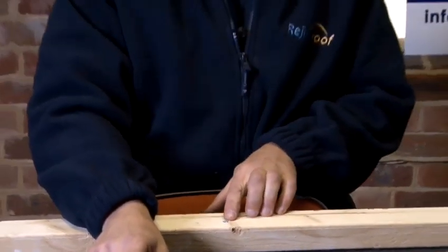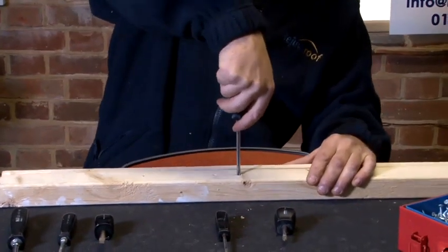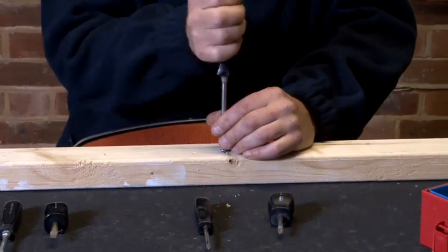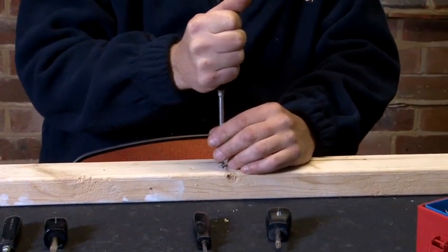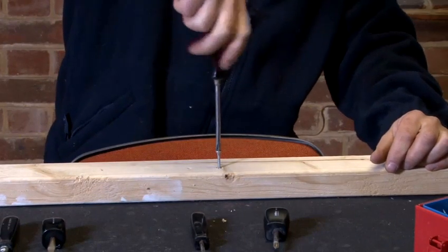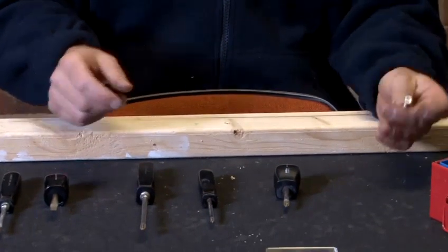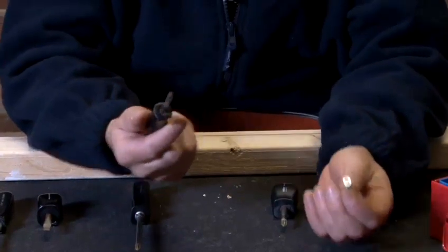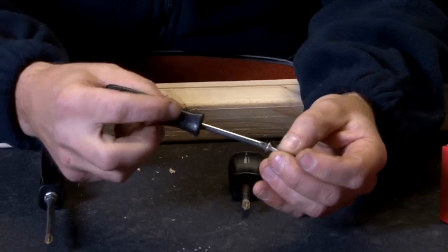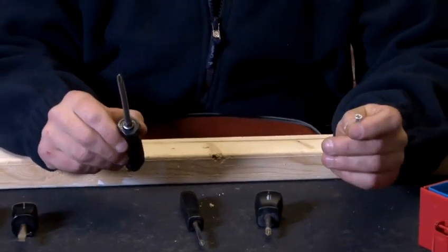Now to remove a screw from this piece of wood, again making sure we choose the right screwdriver for the right screw head — very, very important. In this particular instance, we're going to use this screwdriver because it's the right head for the face of this screw. Place the screwdriver over the top of the head and turn anti-clockwise, not clockwise — clockwise to tighten the screw and anti-clockwise to undo the screw. It is important to choose the right screwdriver; if I were to remove this screw with one that's too small, I would have great difficulty and probably strip the screw, meaning I won't be able to remove it from the wood.